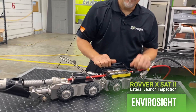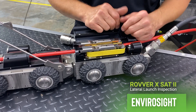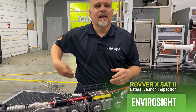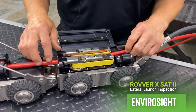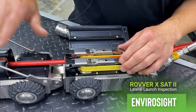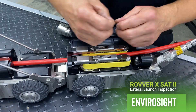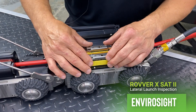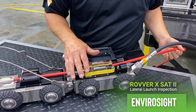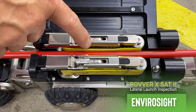Inside, we made some major changes — so much so that what you're looking at is patent pending. The industry said one of the main components that we find that has excessive wear is the cable. Like others, we have worked on the actual construction of the cable, and we have a very abrasion-resistant cable — it's thermoplastic reinforced by fiberglass. But what was causing the most abrasion is not actually in the lateral; it was designed by the machine itself where the abrasion is occurring. Most lateral line systems are using either a wheel that is diamond embedded, gearing, or something to squeeze the cable and push it. With the three motors on the reel, this is not pulling from the reel and pushing up the lateral — all it's doing is pushing up the lateral while the reel feeds it from behind.